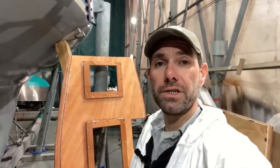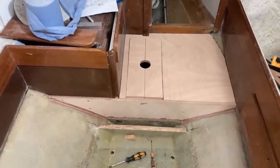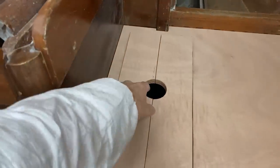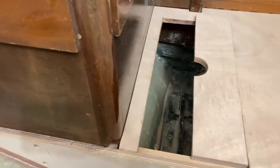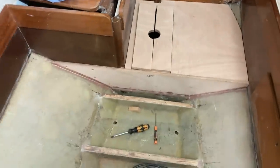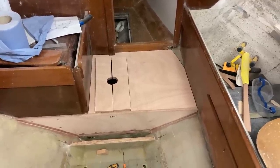I've also been working on a few other projects on the boat, things like removing all the U-bolts on the deck so that all the holes can be sealed up and re-drilled because the whole spacing for the new U-bolts is slightly different to the old ones. Back up inside the boat you can see this is the step or the base certainly for the step, and whilst there's only a small hole there that will be enlarged to go around the mast, these two boards lift out to allow access to where the mast step is. I need to put some framing in around those lift-out boards just to stop them from falling through, and I'm going to put some additional support in underneath there and also do a bit of glass work.